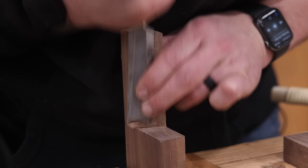For my dovetails I'm going to use a hybrid method. I've got a custom ground table saw blade that's ground to seven degrees, so I'm going to set my table saw to seven degrees and use that to cut all of my tails. I'll then reference those by hand and cut them out at the other workbench. This allows me to only measure once, cut everything all grouped together, making my tail cutting perfect and really fast.